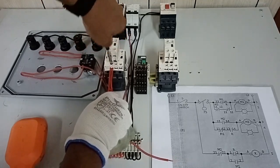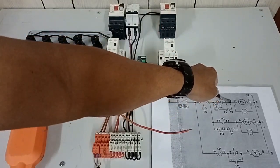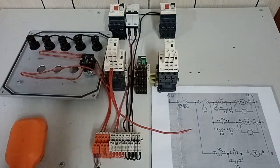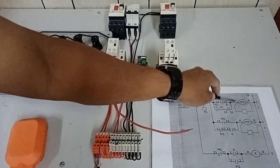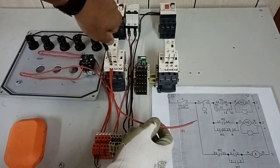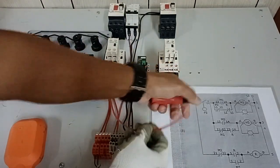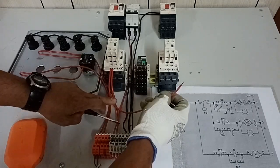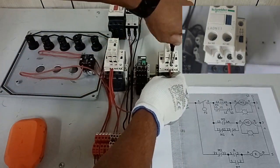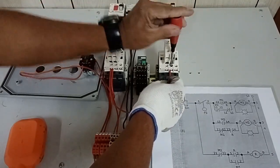This is our interlocking. According to the drawing, it is here. It can also be placed near the A1 terminal of our M1. Both positions I have already wired. I am sure the interlocking will work wherever we place it. According to the drawing, it is here — this is now our system. I will also place this wire on the normally closed contact of our M2 contactor.